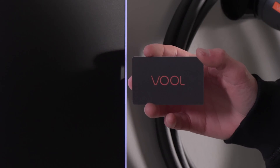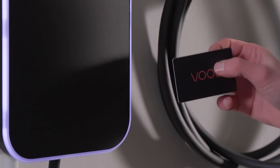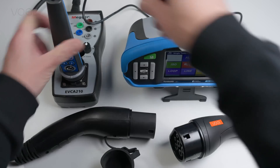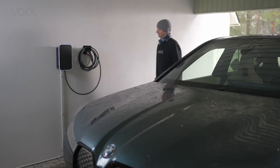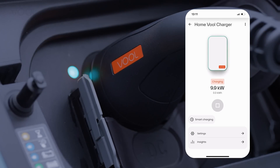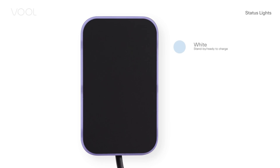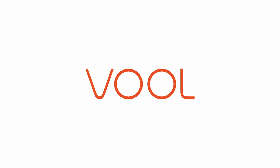In case you need to set up an RFID card, you can do it on the VOL Portal. You can use any compatible RFID card. When setup is done, perform an RCD test on the charger to validate that the circuit works correctly. If possible, test charge an EV. Familiarize yourself with the various light indicators and what they mean — you'll find the full light indicator sequence in the installation manual online. The installation is now complete and the VOL charger is ready for use. Remember to give the RFID card and installation quick guide to the new owner. Thank you for choosing VOL.